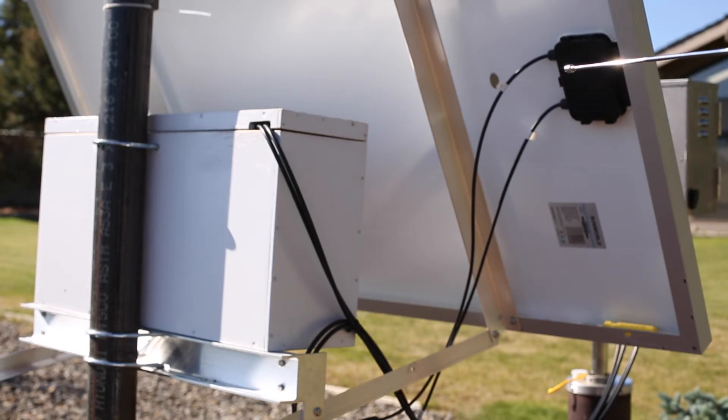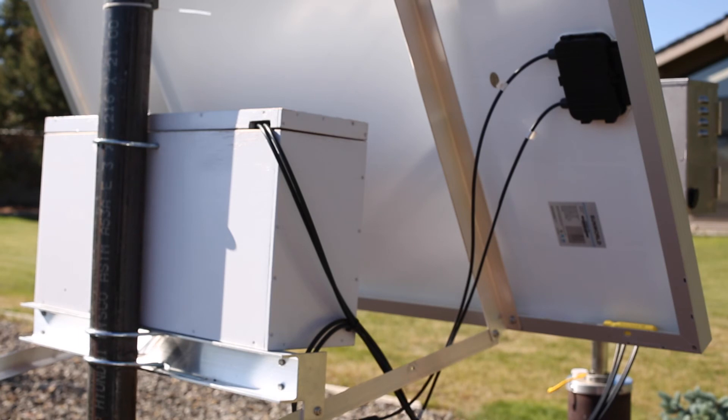We have a Baltic plywood battery box that's been painted in white epoxy. The cables with their connectors run in to make connections to the two batteries — Group 21 or Group 31 batteries, approximately 100 amp hours. With that level of 100 amp hours and the amount of energy consumed by the drive — right now drawing about 5 amps at 24 volts DC while pumping — if we have 100 amp hours of capacity, that means we have, with inefficiencies factored in, maybe 16 or 17 hours of autonomy where the system can run without any sun at all and deliver a fairly substantial amount of water.